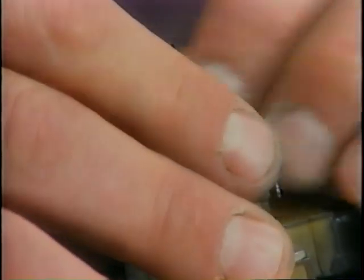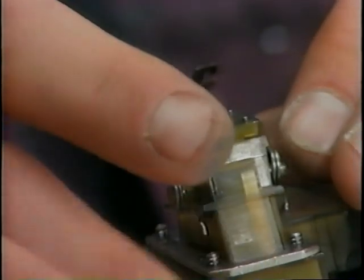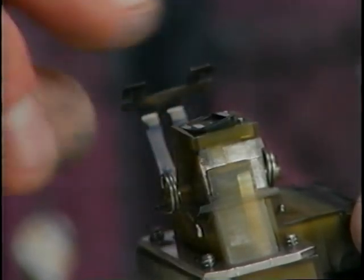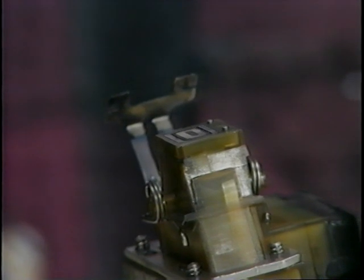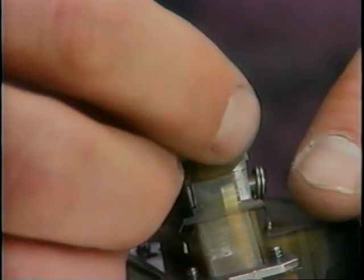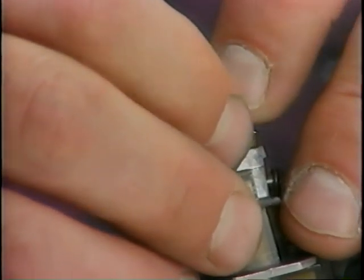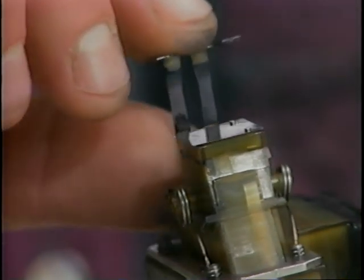Replace the hanger mounting bracket, then clip the spring arms into place. Install the array plate O-ring, making sure it is seated in the groove. Install the array plate. The square hole should be oriented to the bottom of the printhead. Secure the spring arms over the array plate.